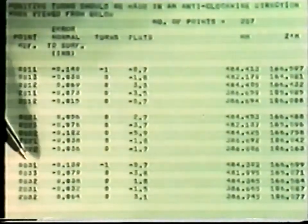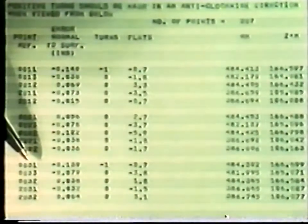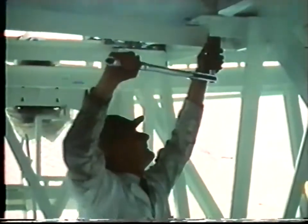The petals are adjusted to the best fit paraboloid using a torque spanner on the special adjustable mountings. These mountings allow for differential thermal expansion, but remain stiff normal to the reflecting surface. The aerial reflector has now been set and the aerial is ready for radio equipment to be installed.